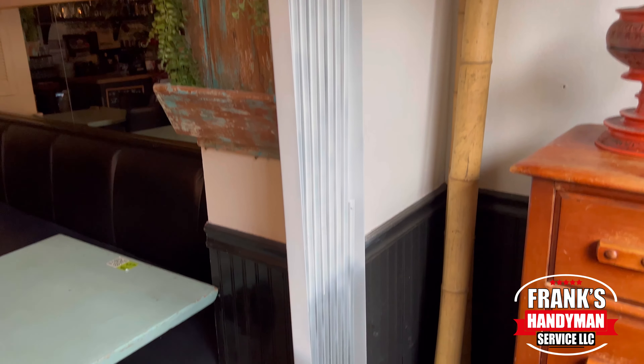On this other side as well, I'm trying to place plastic and cardboard everywhere. If you have a drop cloth, just make sure that all the surrounding area is covered so when you're spray painting, nothing goes on the floor or on the furniture. This will allow you to paint no matter where you're at. I'm placing that cardboard right there, lining it up with the trim of the black part, and then just painting everything. The metal has the front and then the two sides, so you have to paint it on different angles — from the front, then on the right side towards the left, and then the left side towards the right — so you can get all of the surfaces of the metal.